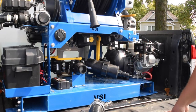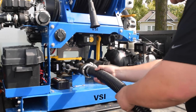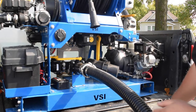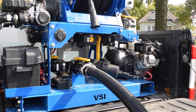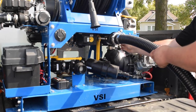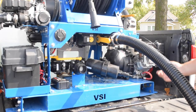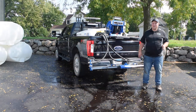Our units continue to be equipped with the very underrated self-fill and pump-out feature. To use a self-fill, we use a cam lock hose, make our connection, the other side of the connection goes to your storage tank or whatever you're pulling from, open this valve, isolate our tank, and then open our bypass valve — that's going to take the liquid from the holding tank into your pump and right back into the tank. If you're going to pump out to fill a snow raider or another spray unit, you close the bypass, connect up, and now you're using your pump to pull from your unit tank into whatever you're filling.